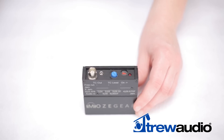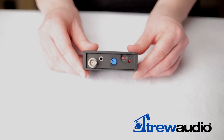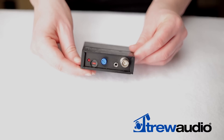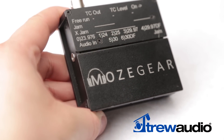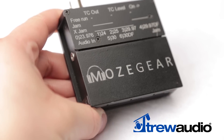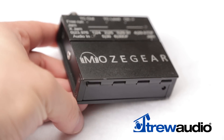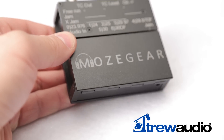While the flow-through audio feature is a great tool, none of it would matter if the TIG could not deliver drift-free timecode for a full production day. The TIG's Temperature Controlled Crystal Oscillator, or TCXO, is accurate to 0.5 ppm and will stay frame accurate for more than 6 hours.